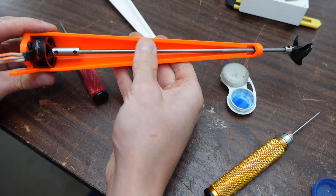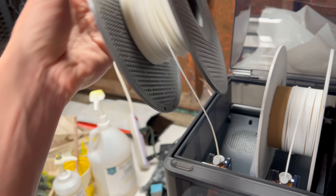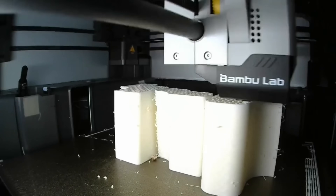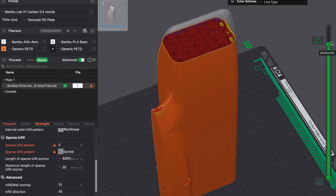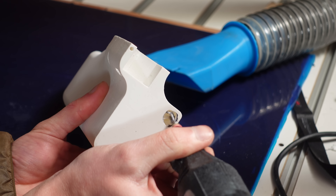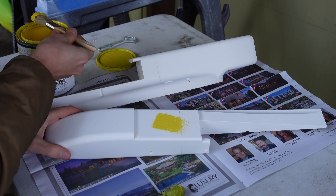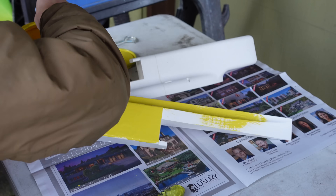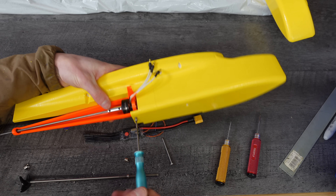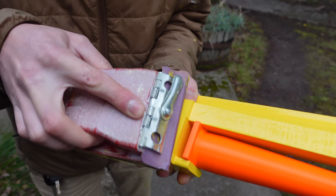A ground effect vehicle long tail speedboat motor pod thing! Now it's time to build the rest of the wingtip float. I'm using the same Bambu Lab ASA Aero filament I used to 3D print the rest of this airplane. The issue with 3D printing stuff that's going to go in the water is that it's hollow and can potentially fill up and sink. To deal with this I used a gyroid infill so that the inside is one continuous volume, and I'm cutting holes in each individual component so the internal volumes of every component are connected. That way I can have one drain plug and pour any water out that accumulates inside. Each float consists of two parts glued together, then painted in polyurethane paint to hopefully keep water out in the first place. The long tail assembly just bolts on with one long M3 bolt, and you can see it pivot — very nice. The surface finish was a little rough after painting so I quickly sanded it with fine grit sandpaper.